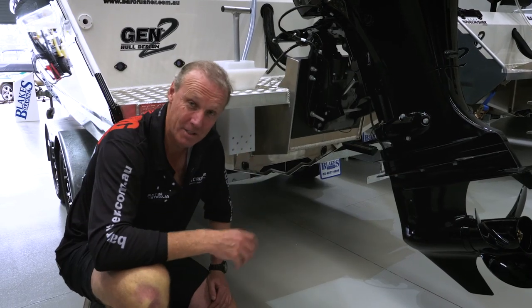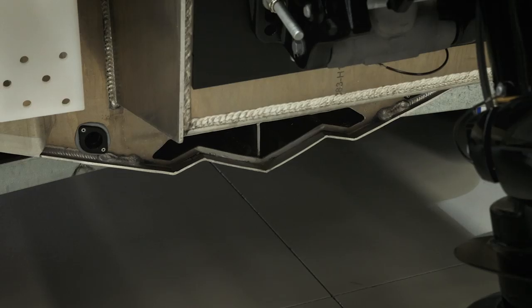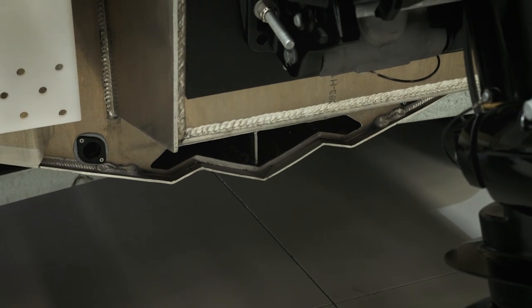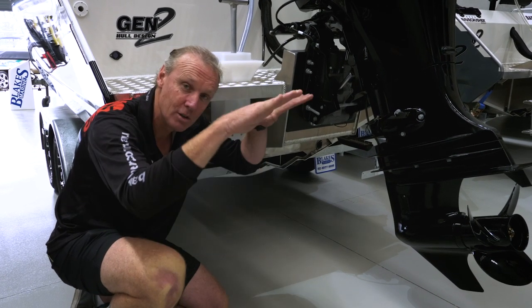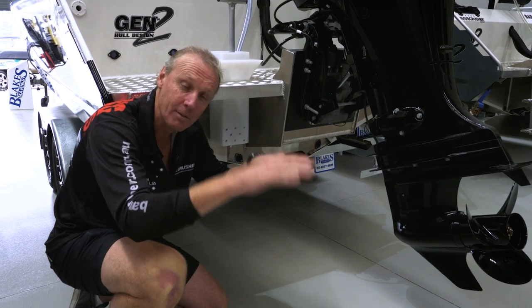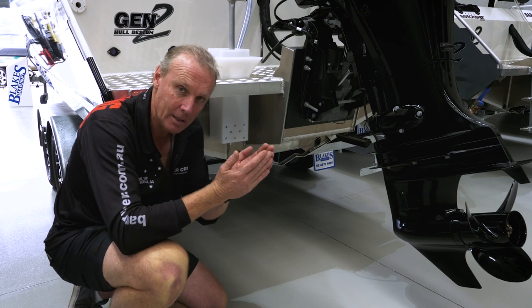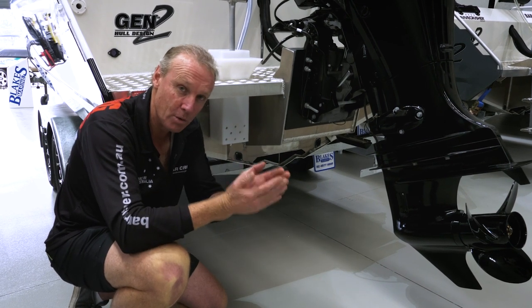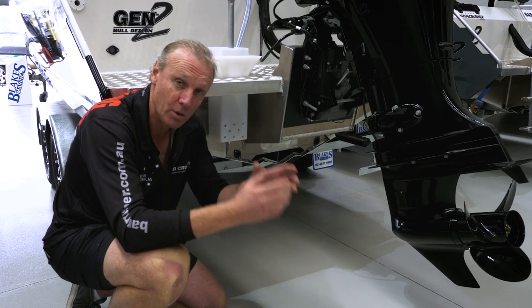One of the iconic features in all Bar Crusher boats is what we call our Quick Flow water ballast system. It's open at the transom and has a cavity that runs up the centre of the hull. When the boat stops, water floods in, reduces the buoyancy and drops the chines down into the water, giving the boat great stability at rest. What it allows us to do is build a deeper V into the hull for great rough water performance when running, and great stability when stopped. It works really well — we think all good fishing boats should be water ballasted.